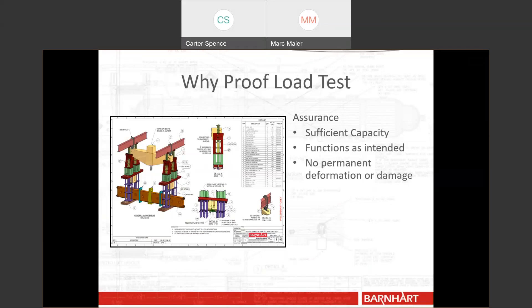In addition to safety reasons, you need to think about the regulations for load testing. There are some standards that govern our industry. Probably the most detailed is the ASME B30 standards — ASME being the American Society of Mechanical Engineers. Their B30 standards outline for lots of different kinds of equipment whether something should be load tested and how it should be load tested. Other organizations have regulations regarding load testing as well, including OSHA, nuclear standards, and ISO 9001.